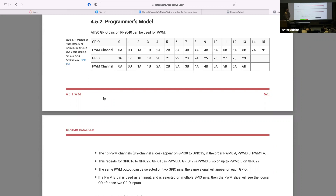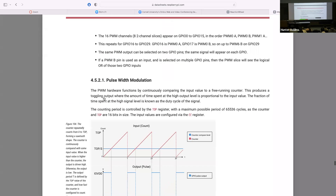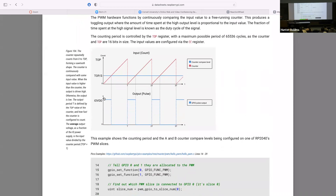They'll have the same period and be in phase, but you can independently control their duty cycles. That's the easiest way to set things up because you can set up an interrupt to fire every time you complete a PWM period, knowing that you've completed a period on both channels. In that interrupt service routine, you can modify the duty cycle of each one synchronously with one another.